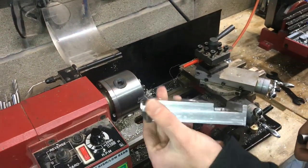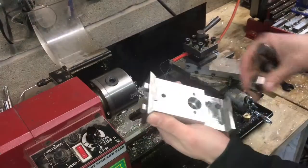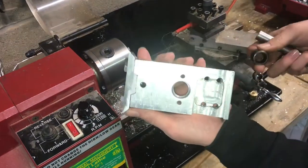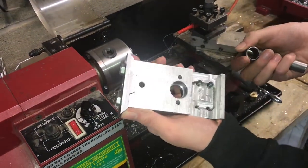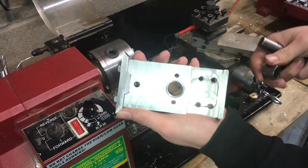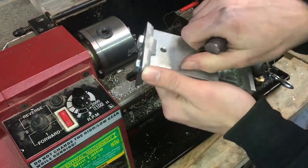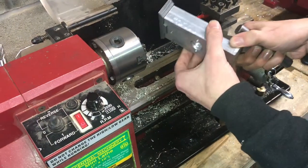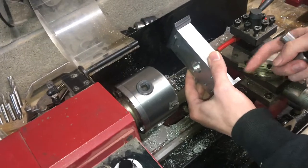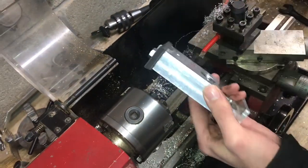This is the beginnings of a BattleBot weapon for a 15-pound bot, and it's looking pretty good, except I've got an issue with these bearing bores. I have a Silver Deming 13/16th drill, but it's a little undersized, and I was able to use a step drill to get it to fit in about a quarter of an inch, but that's not really good enough. So what I want to do is mount it to this mini lathe and then use a boring bar to get the exact diameter for the bearing.